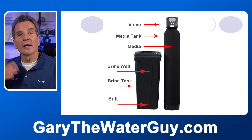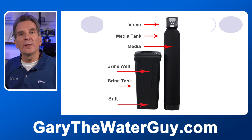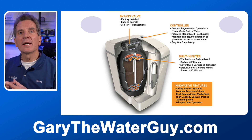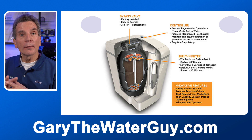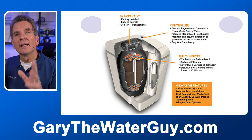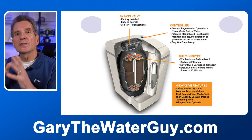When you look at the parts of a water softener, you can see that the brine tank is the reservoir where the salt and the water is. Not every water softener is a two-piece water softener like what you see in this image. Some water softeners are what we call a one-piece water softener — it's a bit of a misnomer because actually one tank is sitting inside the other tank. For the Water Boss or Aquamaster water softeners, for example, the tan tank on the outside is the brine tank, and the black tank on the inside is the media tank.